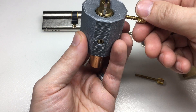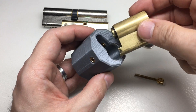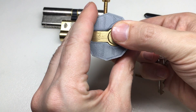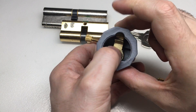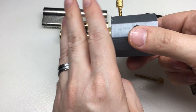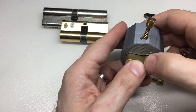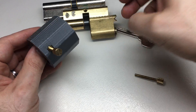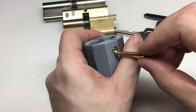This will take shorter and shorter Euro cylinders. You can see how it keeps going shorter and shorter until you get to about the point where if a Euro cylinder was flush to the front at two and a half centimeters, you could still turn the cam at the back. Any shorter than two and a half centimeters it would interfere with the holder. So bear in mind this works for nearly all Euro cylinders you'll ever see, but it does have some limits.